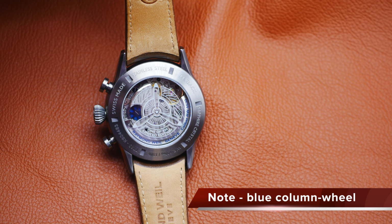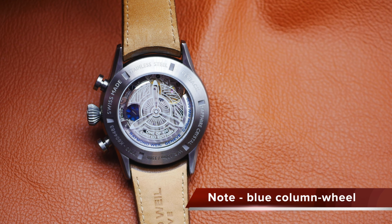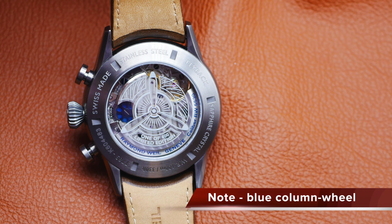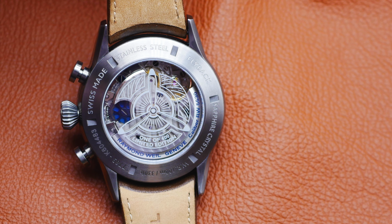On demand, a chronograph draws power from the gear train. This involves using some form of command device and some form of coupling. On many chronographs, this takes the form of a cam and an oscillating pinion. However, on superior chronographs, a column wheel and either a horizontal or vertical coupling is used. This flyback has a fully integrated movement featuring a column wheel and a horizontal coupling.